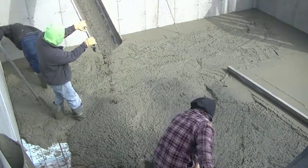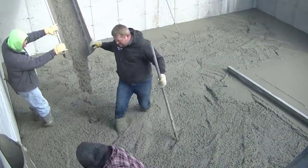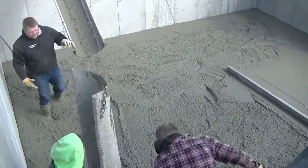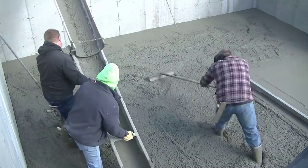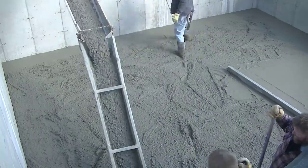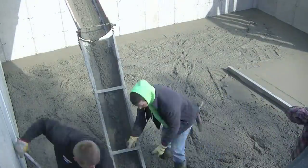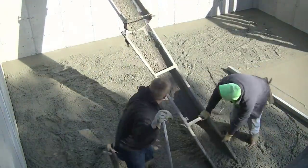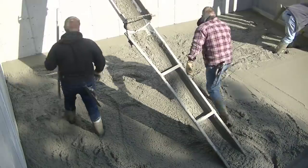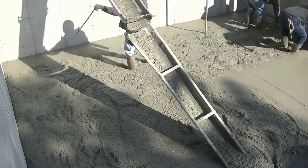Luke's over there getting all the edges magged and ready to screed, because we know we're only going to have a few minutes to get this down, being as hard as it is. It got up to about a high of 34 to 35 degrees today, but it was sunny — so even at those temperatures with the concrete in the sun and the bags of accelerator in it, it still sets up pretty good being outside like this. They ended up finishing troweling about 2 to 2:30 in the afternoon — it's about 8:30 right now in the morning, which gives you an indication of how fast this stuff dries in cold temperatures.